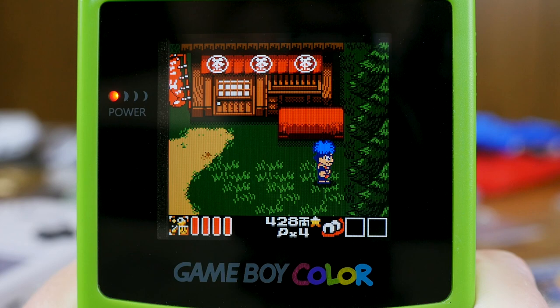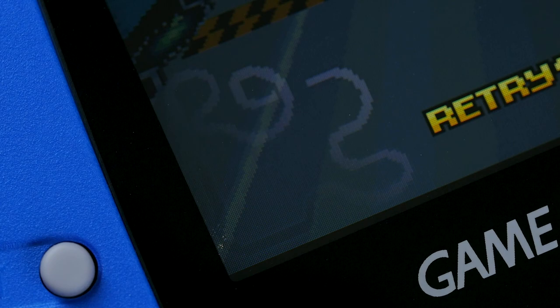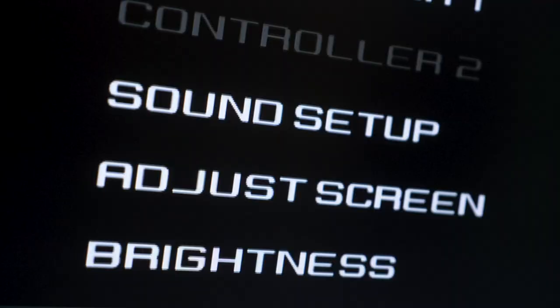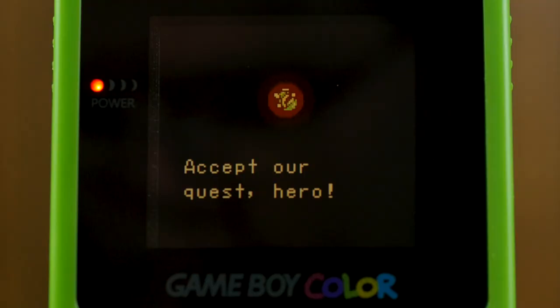This is easily something you would cause from playing the game completely normally. Going back to F-Zero and giving up on the race, when the map is removed from the display, you can see the afterimage for a moment before it fades away. This specific type of image retention caused by rapid flicker is a characteristic of IPS screens we've observed before — not necessarily all IPS screens, but it is a thing. Luckily, I've never heard of anyone getting permanent burn-in on IPS screens from flicker effects, but it is likely to cause temporary retention, and it is disconcerting.